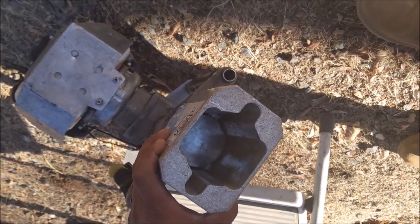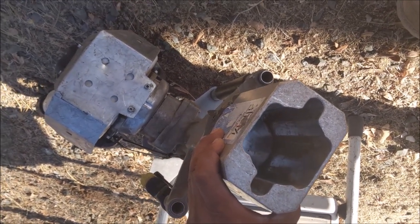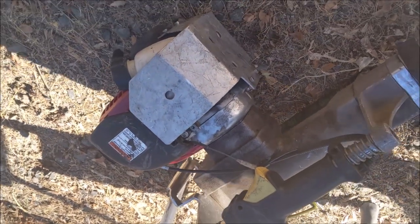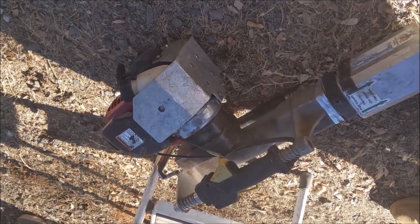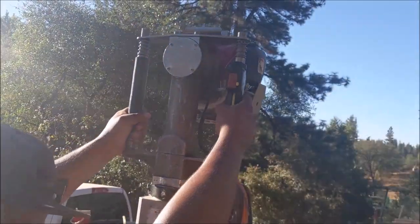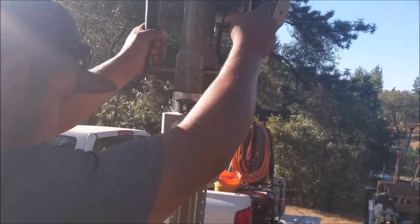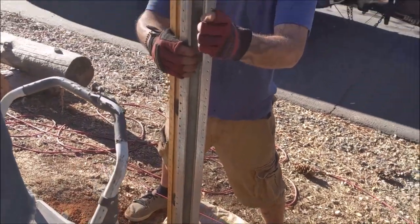The Christie driver can take round poles, square poles, or these channel posts, and T-posts too. That steel driving ram inside was incredibly hard — might have been titanium — because it wasn't marred at all. It has a little weed-eater-style four-stroke engine that can be replaced if you burn it up. One guy holds the post with the level in both planes while the other operates the driver, driving the post another 14 inches past the 10 inches they already dug.